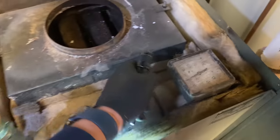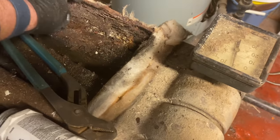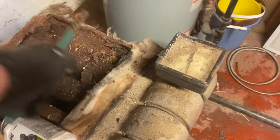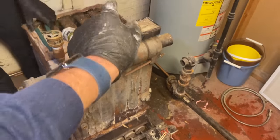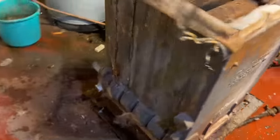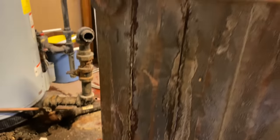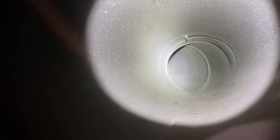Got the front cover off the jacket. Wow, there's our hole right there — you'll see more once we take it apart. Look at that — it's like mashed potatoes. This has been leaking for quite some time and you can see we even got a stainless steel liner right there. She lasted 50 years.